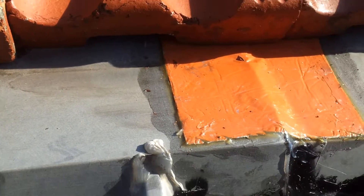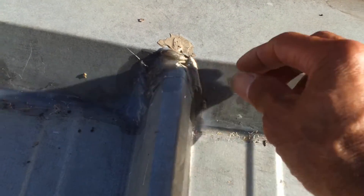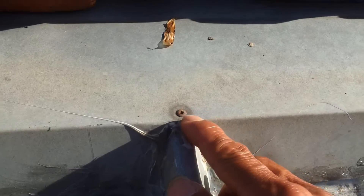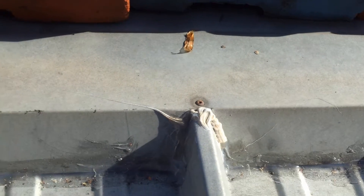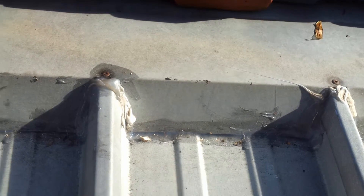You can see that little hole just there, along there. You may get a little bit of a crack along the silicon, and typically water will get in there and run inside and can't come back out again. Which means that water will then leak backwards over the upturn and leak into the house.